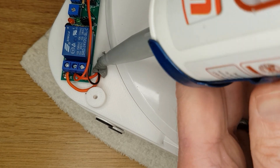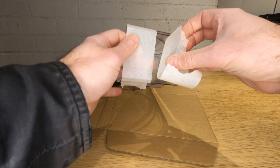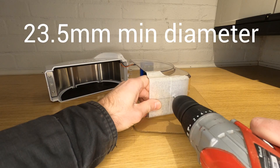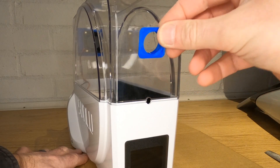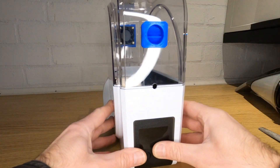Once you know that everything's working how you want, use a little bit of silicone sealant to seal up any gaps and the holes the wiring comes through. To fit the front vent, take the front of the lid as you did the back, and mark and drill a hole as close to 23.5mm as you can — I put my hole centre 55mm up from the bottom of the lid. If the hole ends up too big you may have to glue the mounting plate in. So now we have a fan fully controllable with a timer and two intake vent options.